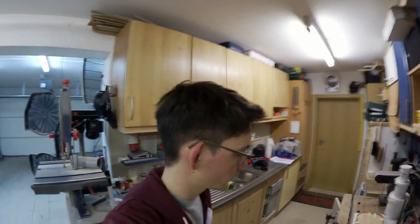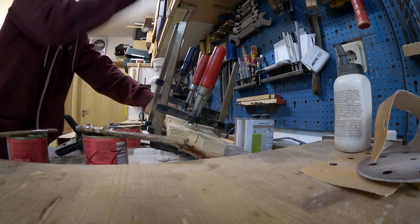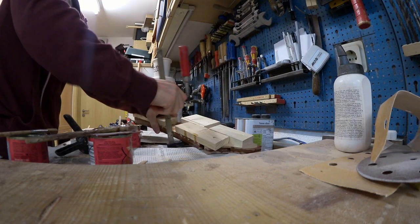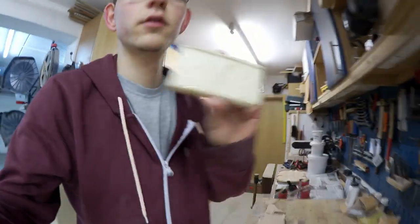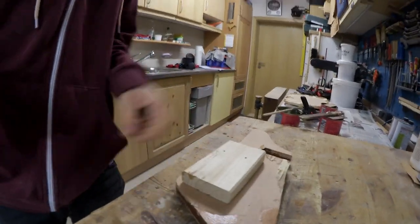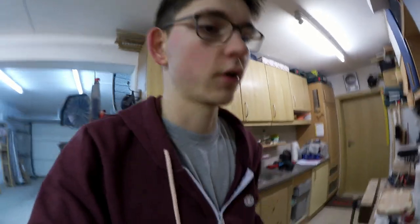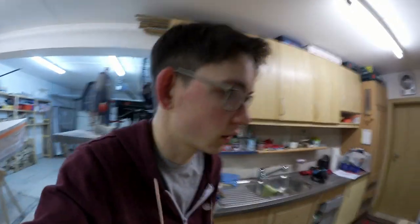Last time when I had a little bit of epoxy left I started gluing up the rudder casing. If you use little wooden bars to spread out the load of your clamps, wrap them in some tape or a plastic bag, because if the epoxy leaks out of your gluing surface they will just glue onto it and it's a mess to get rid of.